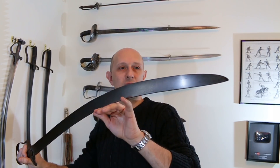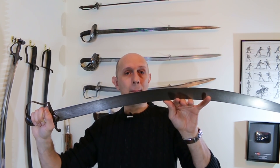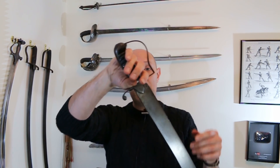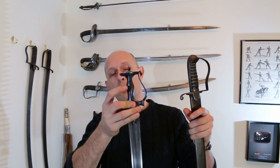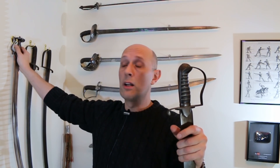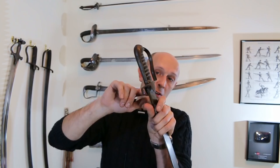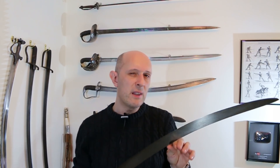The point of balance is about 12 inches from the grip - absolutely way up there. You might think that's a piece of crap, but there's something very special about this blade: I believe it is wootz. I'm 97% certain this is a solid, massive lump of wootz steel. Wootz, as many of you will know, is the crucible steel produced in India and some parts of the Middle East - perhaps near Damascus, perhaps related to the name Damascus steel, though that's a contentious issue.